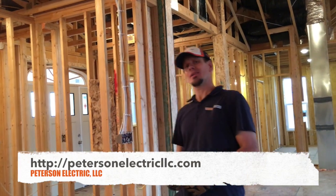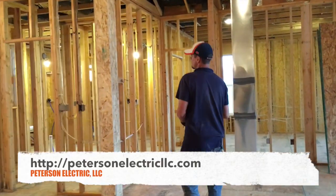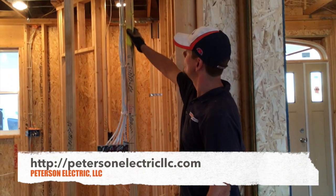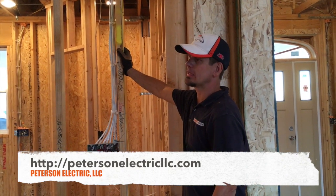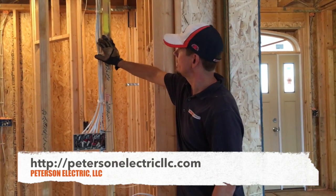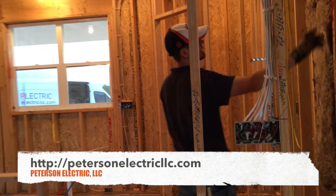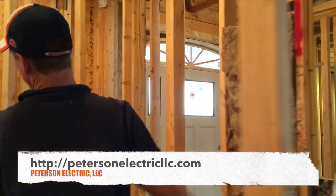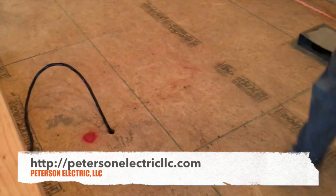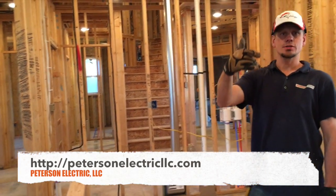That's the reason why I do that testing. The other thing we like to do on our rough-ins — just for you guys doing your own home — we take yellow paint and hit all of our 14-gauge wire 15-amp circuits. For instance, here in the kitchen, if it's a 20-amp, 30-amp, or 50-amp you just tag it with red. That way when I'm coming through and marking all my home runs — which means from that point all the way back to the panel — I know the amperage.